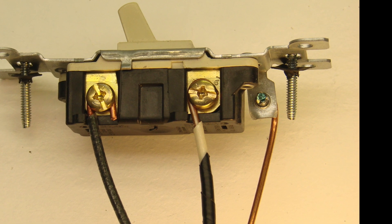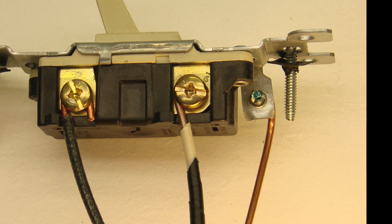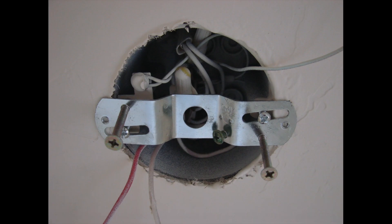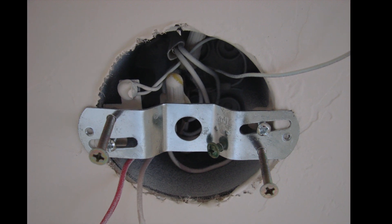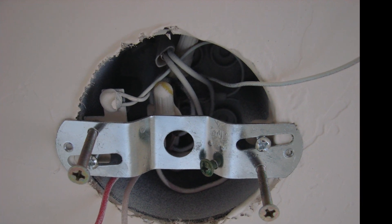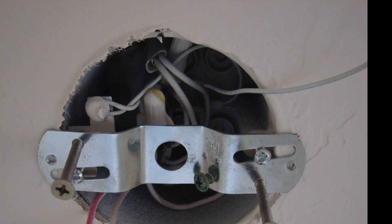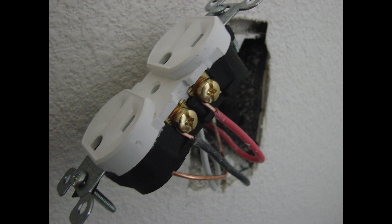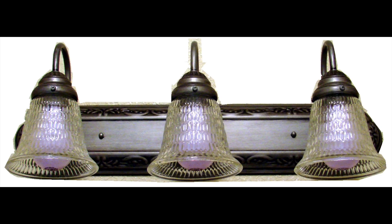If you tried to make it work, you'll discover that it will not work. The power for the circuit is either up in the ceiling for a light fixture or down at a wall outlet. Now, if it's a wall outlet and you have a switch on the wall to control a table lamp or a floor lamp, then yes, the wiring can be changed if you wanted to convert that situation to add a light fixture. The wiring would have to be changed at the wall outlet so that you have a hot and a neutral up at the switch, and then you could wire out of the switch up to the ceiling to install a fixture or ceiling fan.